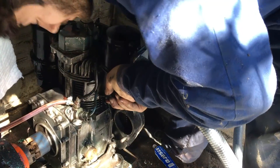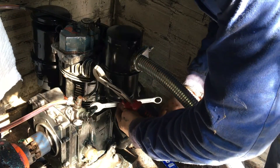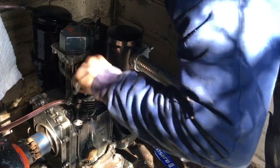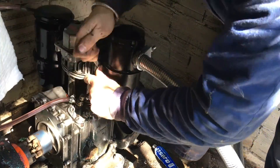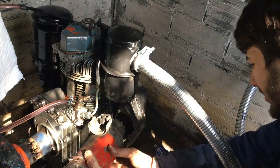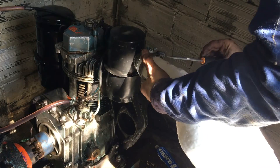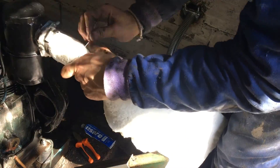The silencer was slightly interfering with the injector pipe so I just bent it slightly with whichever tool I had lying around. And now with the 13mm spanner I bolt it back on, just making sure the silencer doesn't interfere with the starter motor solenoid anymore. I will now wrap the exhaust with some ceramic insulators to prevent burns — this sequence is one minute long so bear with me or skip it.